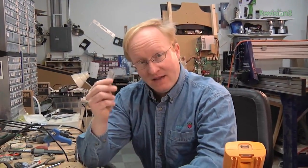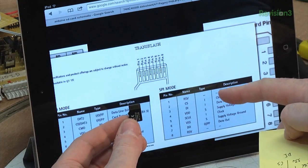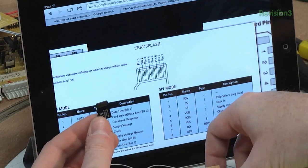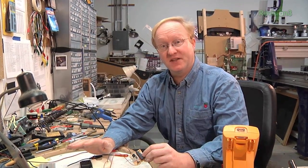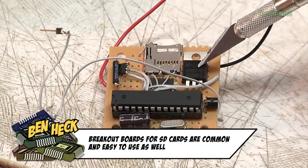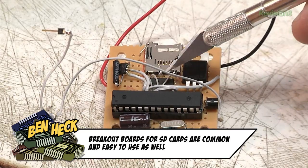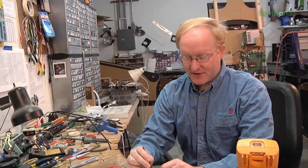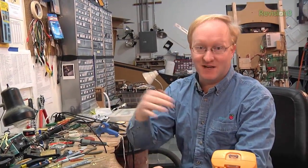Time to wire up the parts. I've got a little PCB socket for the chip and my surface mount micro SD card connector. In the next episode, we're actually going to have a tutorial on how to wire a surface mount, so stay tuned. I'm going to put these things together and then test them before I put them in the car. On the screen I have a pinout of a micro SD card to make sure I get the orientation correct when I wire up the slot manually. The parts are all wired up. We have the microcontroller, 3.3-volt regulator, SD card, level shifter, current sense integrated circuit, capacitor for smoothing, and the crystal. I also added a transistor because the microcontroller doesn't have enough power to run the piezo, but it can flip a transistor switch, and that can power the piezo.